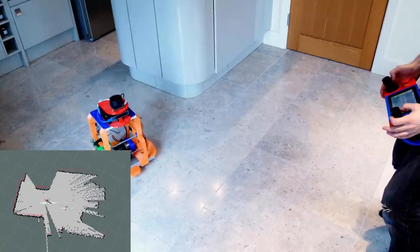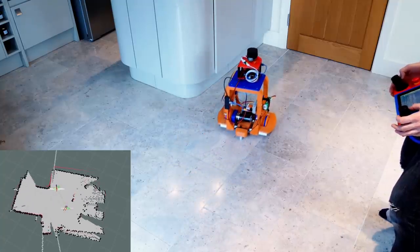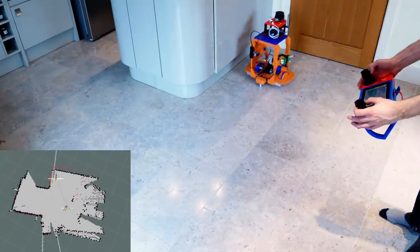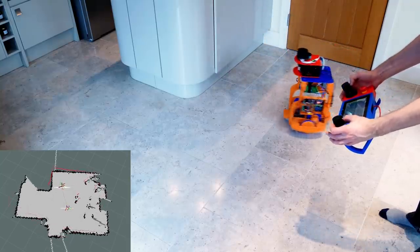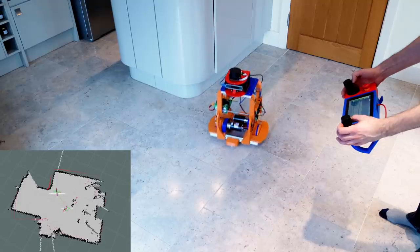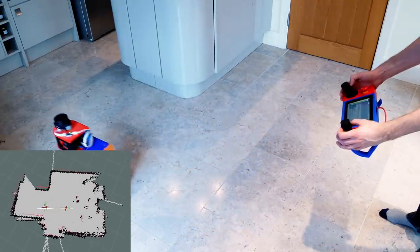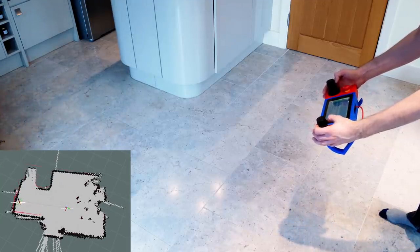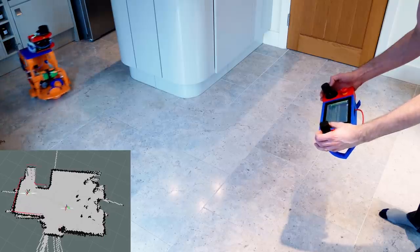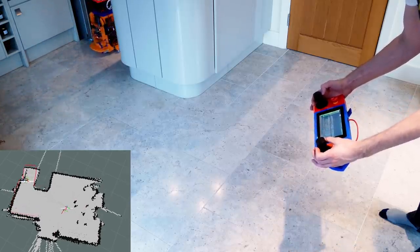First of all, we've got to create the map, and I'm using ROS Gmapping. I'm driving the robot manually using my universal robot remote, and you can check that project out in my channel as well. The remote's based on a Raspberry Pi with a 7-inch touchscreen, and it just issues the command velocity topic with a twist message for the joysticks. I've also got buttons on there and the capability to build a touchscreen interface, but there's more in the dedicated video about that.